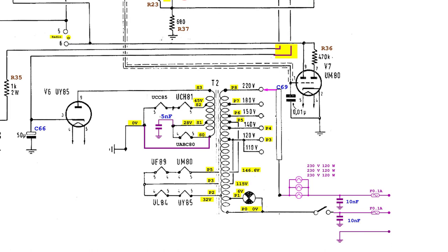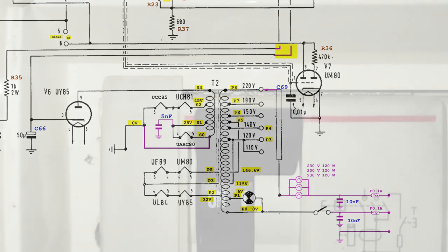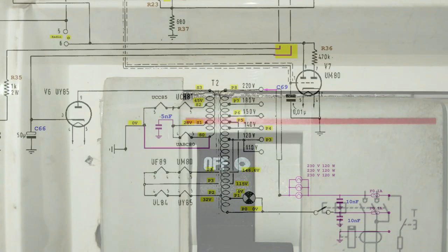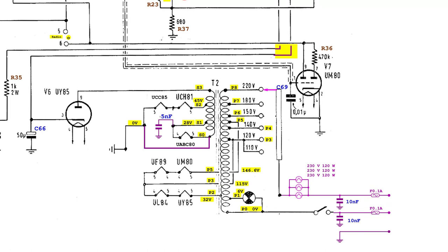However, if the leakage becomes excessive, that would trip the residual current circuit breaker. Under the circumstances, the user of the radio might be tempted to power it by omitting the external ground, making dangerous the contact with the chassis. Hence, isolating the chassis from the operator remains necessary.